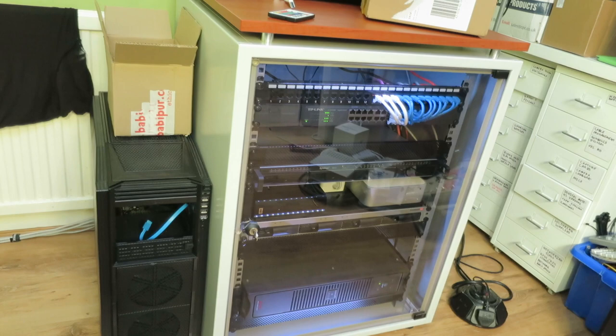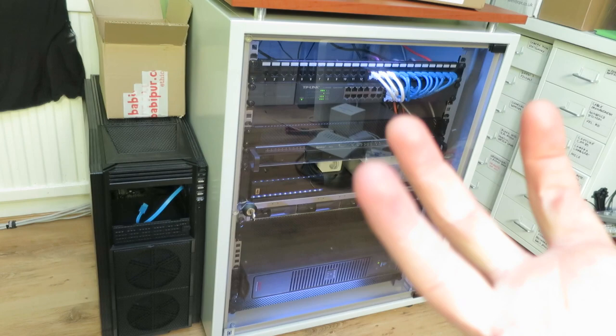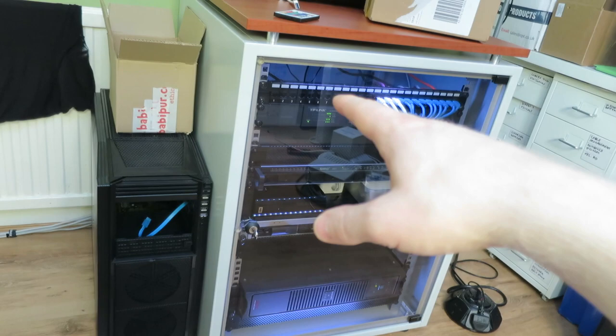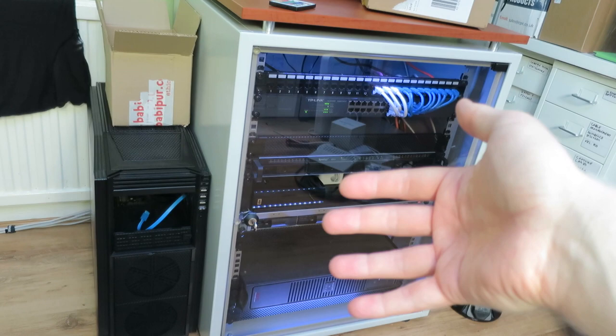And I think one of the main reasons for that, there's lots of different reasons, obviously, but we are putting just PC fans into a case this size, and we're essentially trying to cool three PCs worth of equipment with one intake, one exhaust, and just one little fan floating around in the middle to try and help things out, which may or may not be helping, you know. So it's not a great deal of cooling.